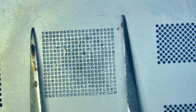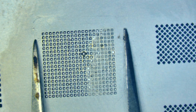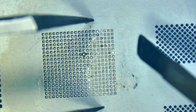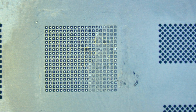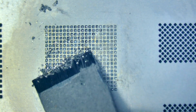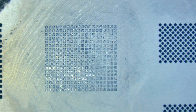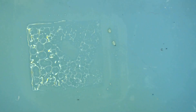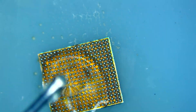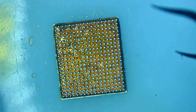When you notice this, there are two ways to fix it. Either start all over — wick everything off and reball it — or you can use this other method which definitely works but can potentially take longer. It involves adding more solder paste to the stencil and then shaving off the top of the solder wall in the stencil, because as solder paste becomes a sphere, part of it sticks above the stencil and you can shave that off with a sharp razor blade. Doing this over and over will start to even out the solder balls across the grid array, and although it may take a little longer, you still end up with a nice result.